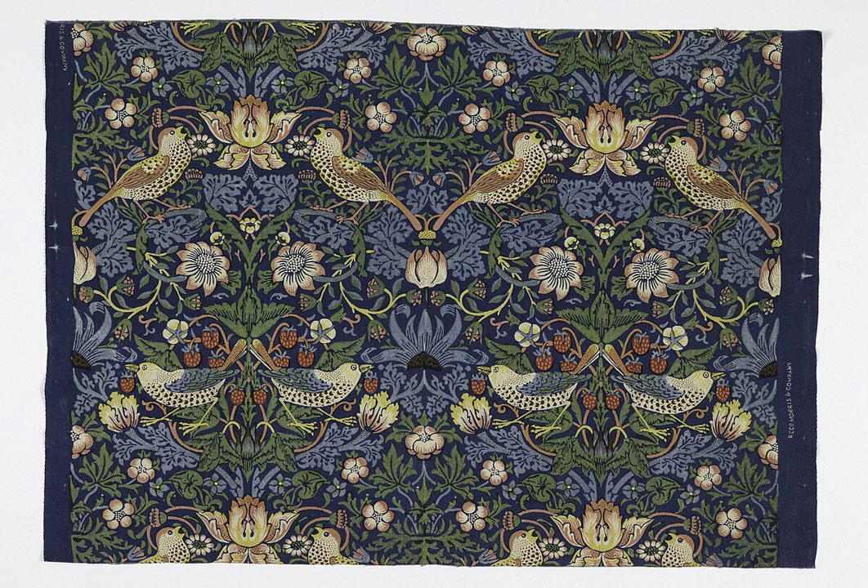Process. Printing is the process of adding localized or pattern color to fabrics. Discharge printing involves dyeing first with dischargeable dyes; subsequently, the dyed fabric undergoes a printing process involving the application of a chemical-infused paste that effectively removes the color imparted by the dye. The process follows steaming and rinsing stages. The selection of reducing agent or stripping agent depends on the dye. Extract printing is simply another term for discharge printing.